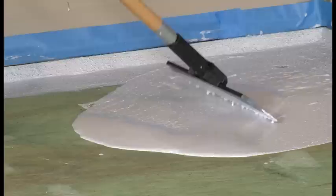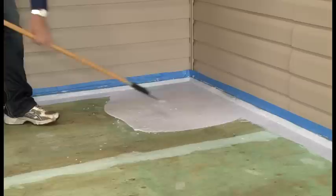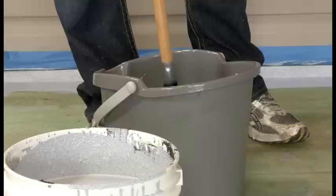Using very light consistent pressure, spread the puddle, moving the blade to evenly disperse the product. Spread the texture coat in a consistent way, using a left and right motion and pulling it towards you. On your last few passes, pull the blade down across the bare plywood to get the excess product off the blade. This helps keep the product from dripping from the applicator as you lift it to do another pass.